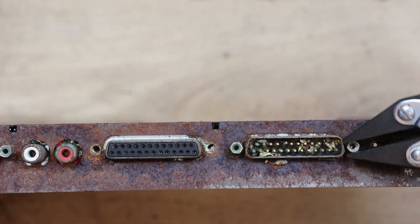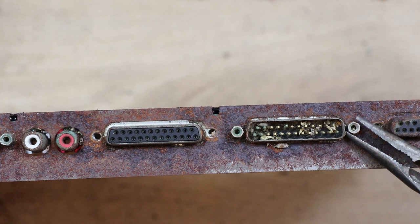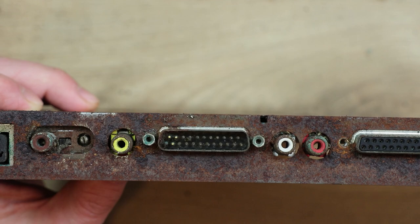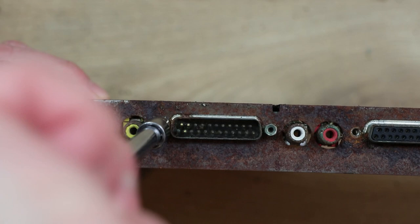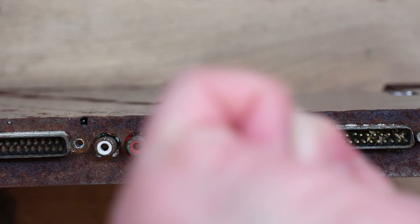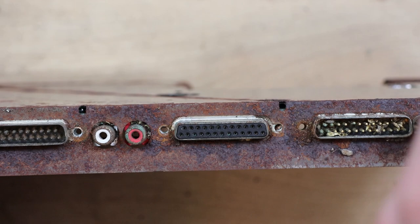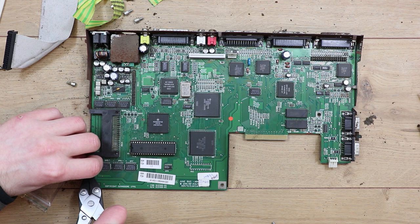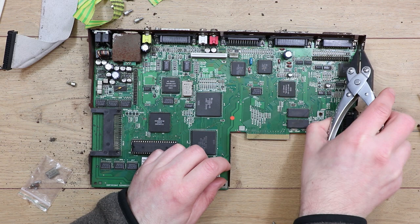The ports are not the best — you can probably see this pin here that's all going green. These could be cleaned up to some extent, and if I can replace them I will. The 23-pin sockets for the floppy drive and the video port — they're not so easy to get hold of now, and where you can get them people are trying to charge a hell of a lot for what they are. There are parallel pliers — as you close them up the jaws close mostly parallel to each other, unlike normal pliers which close at an angle. These are quite good for jobs like this because you can get a decent grip and you're much less likely to do any damage.